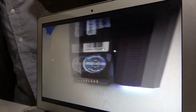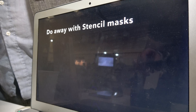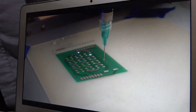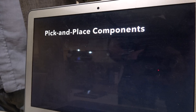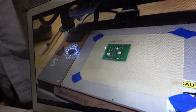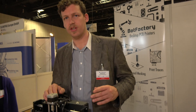To make the second layer, we print an insulating ink covering the whole thing except for where there are vias, which are filled with conductive ink again. For dispensing, to get the parts connected to the traces, we use a dispensing system that extrudes a single-part epoxy onto the pads. The third step: we take components from a tray, use a camera to align them properly, and place them on the bed. We can do several hundred different parts, up to three to five — as many as ten parts per minute.